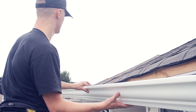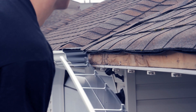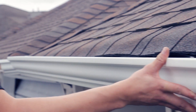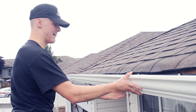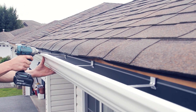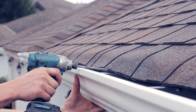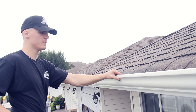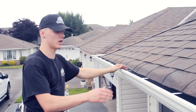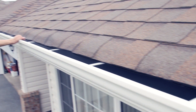First we're going to hook this corner with that hook into the other gutter. You want to get underneath the shingle and hook that gutter so it's nice and hooked, then hold it with one hand. When screwed in the middle, first check that corner to see how high the gutter is, and don't put the corner too low — raise it up. The brackets are spaced 18 inches apart; usually we do two feet, but here we'll do 18 inches so it's stronger and more stable.